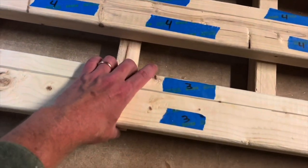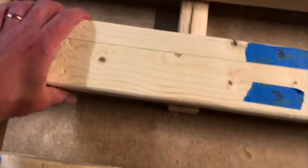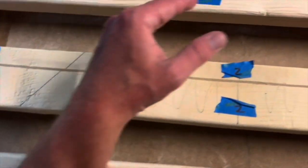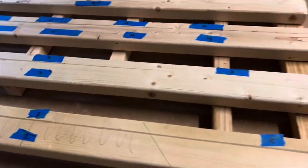I wanted to give a better look at how I'm putting this together. I've got the support beams on the side, smaller one-by-ones on the inside, and some support braces that come up to this third piece, which is at 13 inches — that should give the wheel well enough clearance. I've made a line here where the curve of that wheel well is going to be, but I don't want to screw anything down until I get another measurement of Reggaetron's van tomorrow. I need to confirm how much clearance at the very top because it slants in a little bit, and figure out what tools he wants to put on the French cleats.